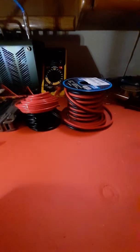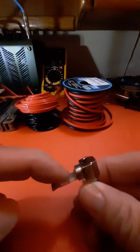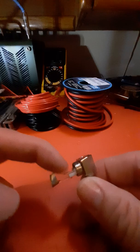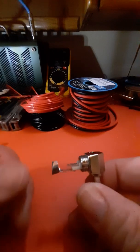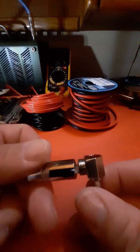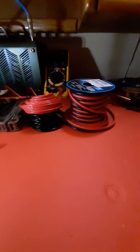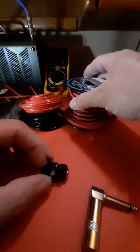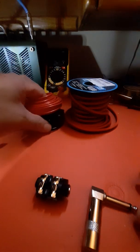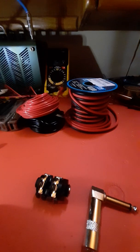It's very easy to wire — positive goes to the center, same as your switch, and the sleeve which is negative goes to the sleeve here. This comes with a little plastic shield inside so you can cover the connection and insulate it. If you guys have any questions, hit me up on YouTube and send me a message — I'll definitely respond. That's how easy it is: a couple of dollars on Amazon, get yourself some switch jacks, speaker wire, and speaker cable, and you'll have a working speaker out in pretty much any amplifier you want.